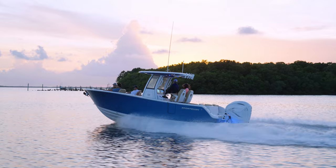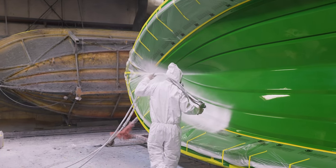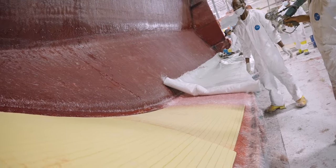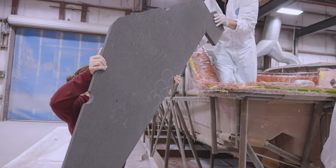The hull is built from the outside in multiple layers. The first layer being the gel coat layer. After that, we apply the skin coat layer, followed by some advanced composites and wrapping everything up with the bulk layer. Certain areas, like the transom, receive special materials for strength and rigidity.